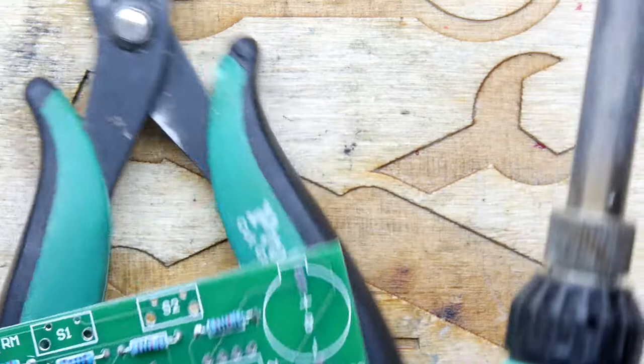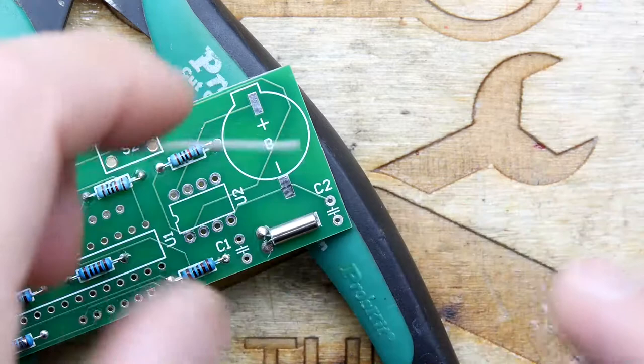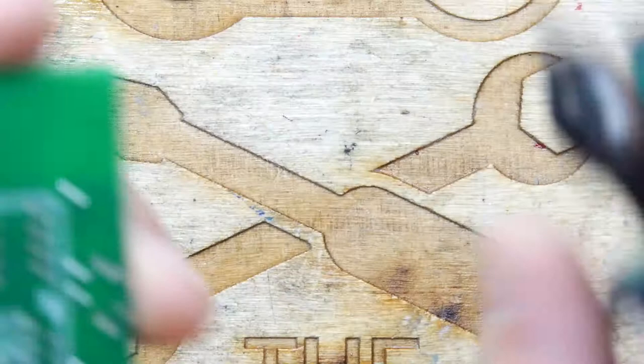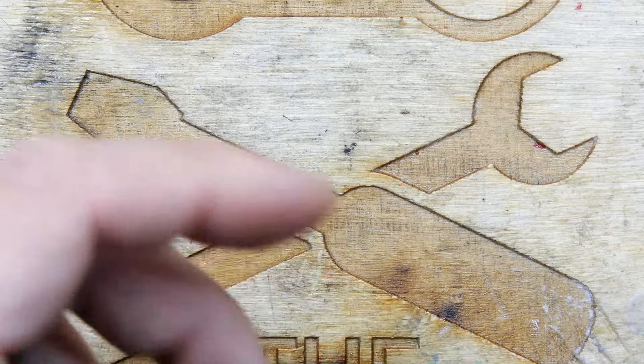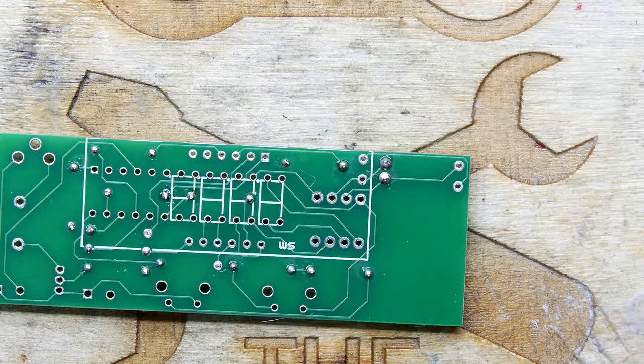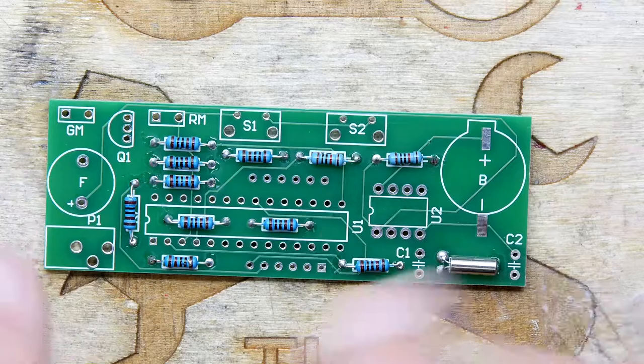So the micros will run faster than real time, it'll run mega time. So it'll take something like this, and then it'll probably run 10 times faster than the oscillator. But internally, you'll know that every 10 flips is a second, and then you'll work everything out that way. The reason you need things to work faster than real time is that your clock is going to be updating its screen, because it's going to be multiplexing and doing all sorts of trickery like that. And if you have it all in per second, can you imagine your display, you'll see the numbers rolling over effectively, which is not good enough. Not good enough at all.